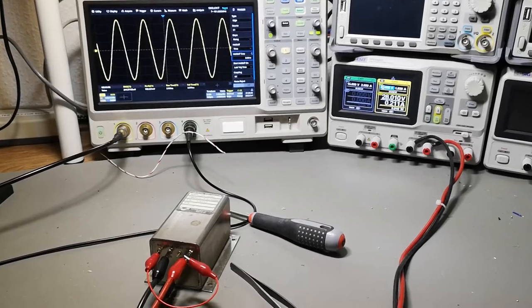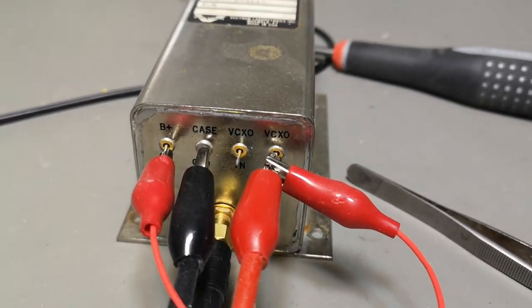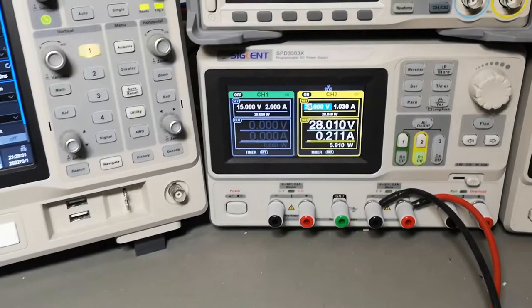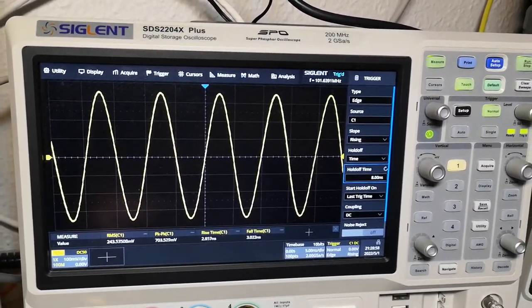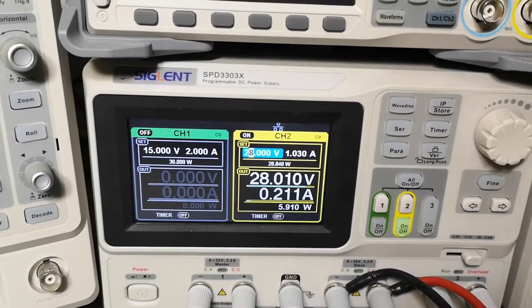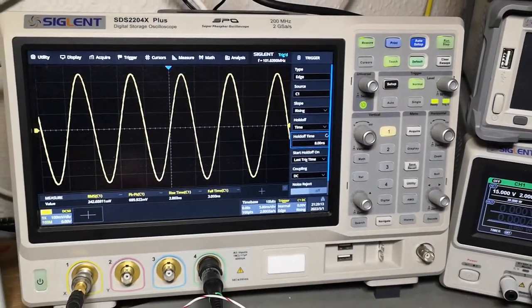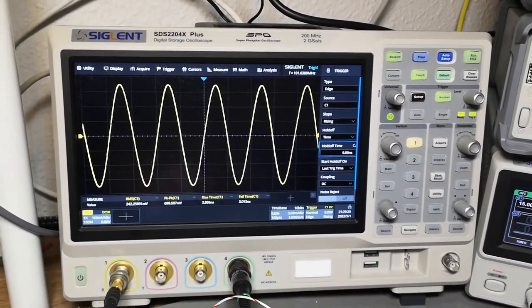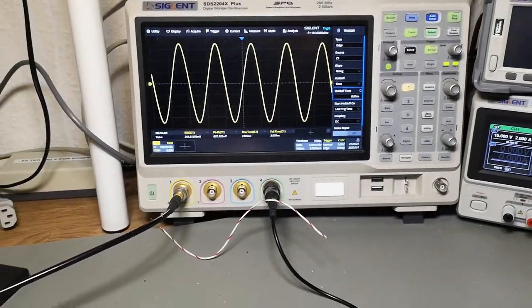We are up and running — it wasn't that difficult to figure out. B+ and the VCXO supply, I just connected them together and cranked up the voltage until the amplitude didn't change anymore, which was at 24V. I gave it a few more volts so the internal regulators have headroom. 28 volts is actually a standard within old HP electronics, and 26–28V is fairly common in telecom as well.